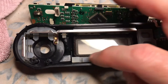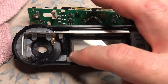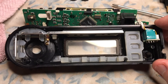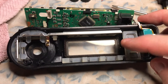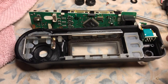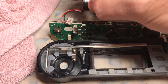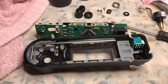This rubber push button assembly from the front actually just sits in there. Be careful — once you take apart and unsolder this, you can take it out and clean the controls, the top and lower buttons. The VFO knob — you have to feed the cable and the plug through the hole to release the VFO knob, and then feed it back in with the new control panel.